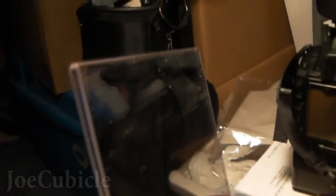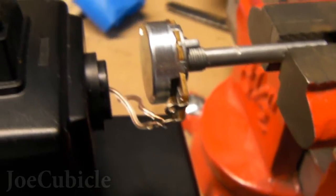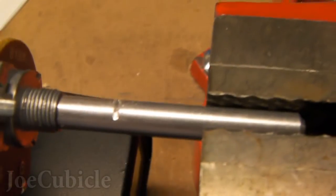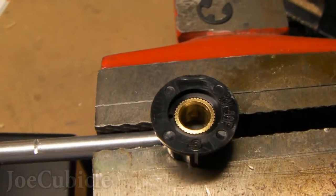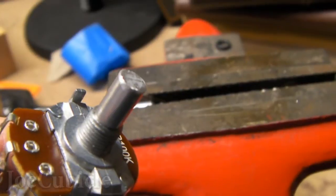Here's what I used to make the box that holds the potentiometer — it's just some clear acrylic from a picture frame I got at Hobby Lobby. It was really cheap and about the thickness I was looking for. Now I'm getting ready to cut the excess stem off of the pot. I've already made a mark and got it jawed up in my vise. There's the knob I'm going to put on eventually — I got it from Radio Shack. It has a nice brass insert with a set screw. I'm using a small hacksaw to make the cut, and I went ahead and sanded it already.